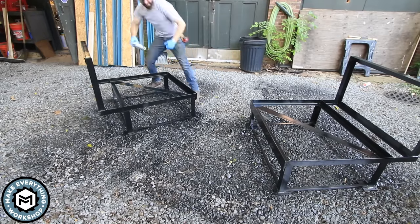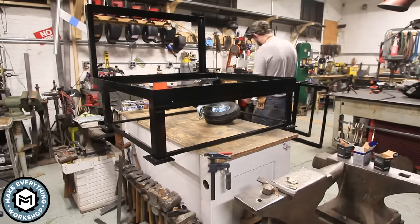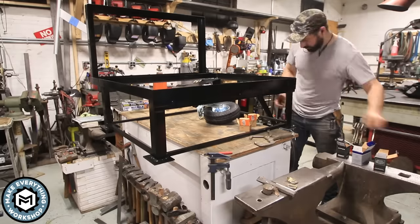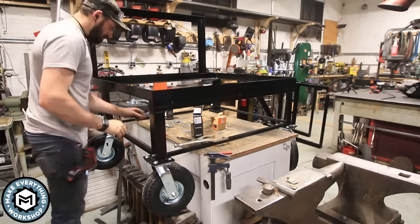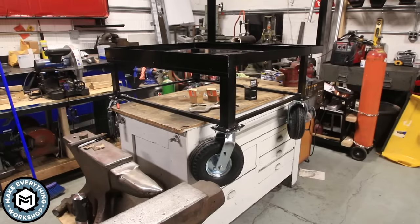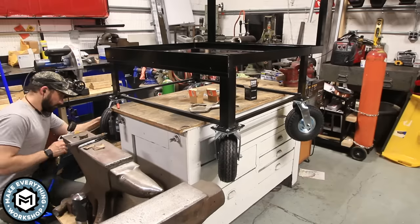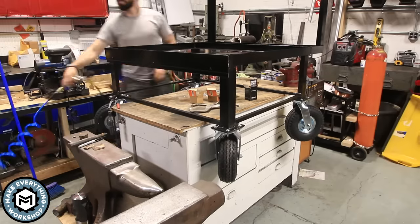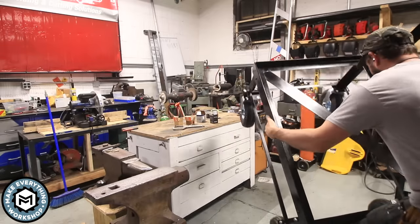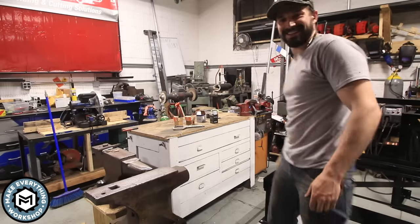Here I'm using a large can of Rust-Oleum spray paint to paint these things with a black enamel. I gave them a couple of hours to dry and then brought them inside to attach the casters. These are 10-inch pneumatic casters that sit 12 inches overall. For quality control, I chose to use screws with a fender washer on top, a lock washer, and a nut — that assembly is going to be really strong and they're not going to vibrate out. Here I'm airing up the tires, making sure everything's going to be good; these are rated for 50 psi. And now I get to drag the cart off and this thing is done. Straightforward project, but going from repairs to this you can make hundreds of dollars per unit on something like this, and it'll pay for your machinery and everything else.